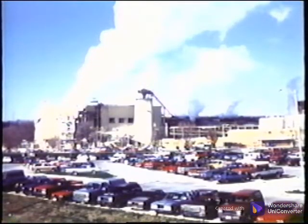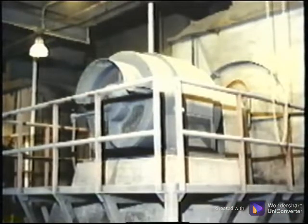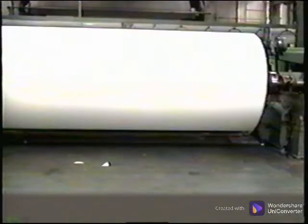Some manufacturing processes require specific and uniform temperatures in order to maintain high quality. Thermal imaging can provide the information needed to correct problems and increase quality production. This example shows the paper from a paper machine as it is being rolled up. It has just come from the dryer section where it should have dried uniformly, yet there is definite streaking indicating a cold area. This area did not dry thoroughly, which points to a problem with the drying process.